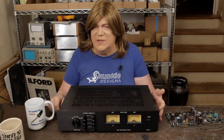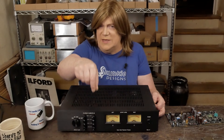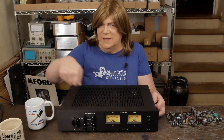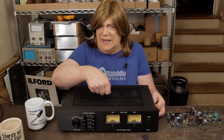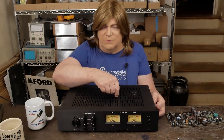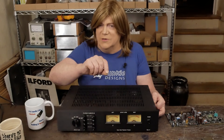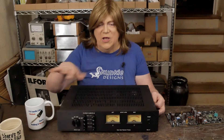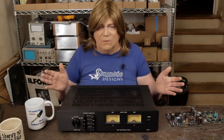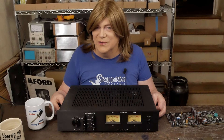The way these things are built, they've got shielded wire that's soldered to the tape heads, which then plugs into the main board. You basically just unplug that plug and clip the two wires and solder them onto an RCA jack that you mount on the back. You're not moving anything, not adding any wire — it's almost like it was made for doing this.